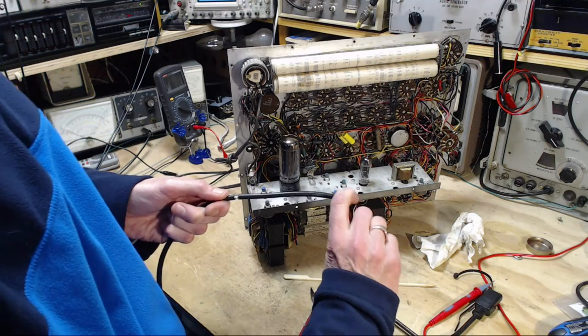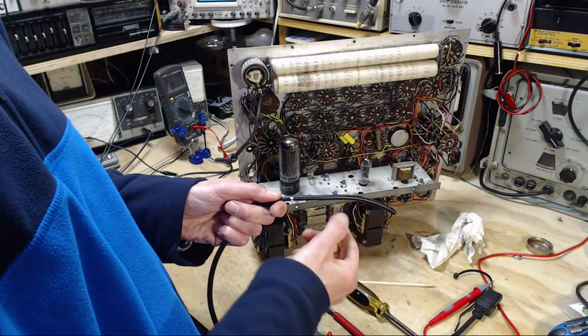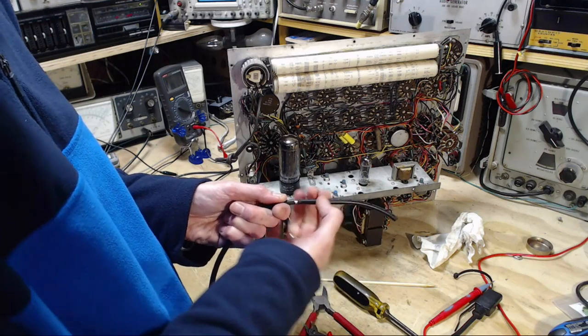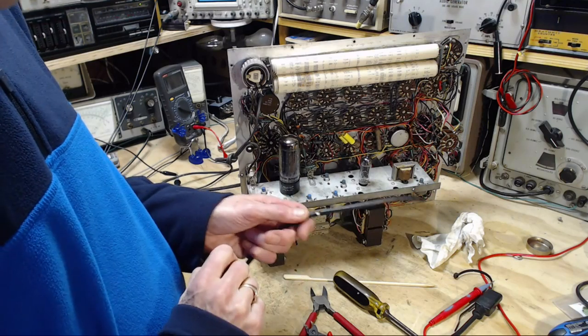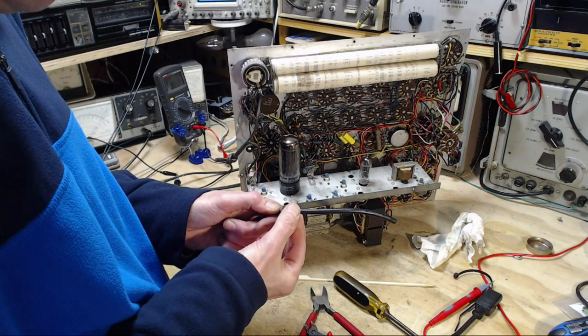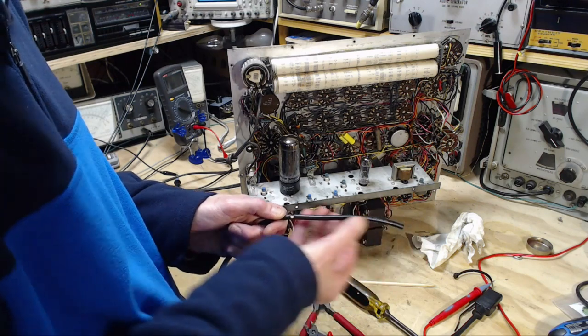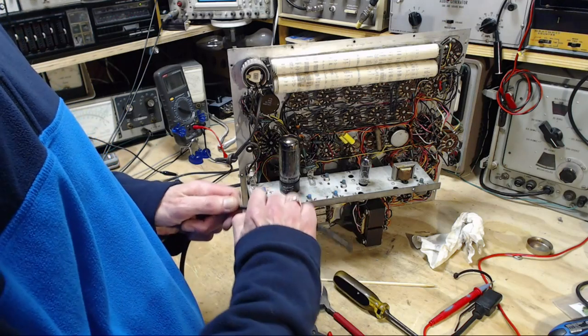If you pull on insulation like this, if you try to pull this off, as you pull it, it stretches thinner, necks down, and grabs the wire. If you push, as counterintuitive as it is, if you try to push it off, you bunch up the insulation, its diameter opens up a bit and it comes off. Is he lying? Let's see.